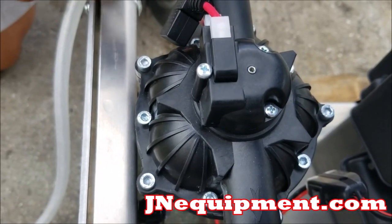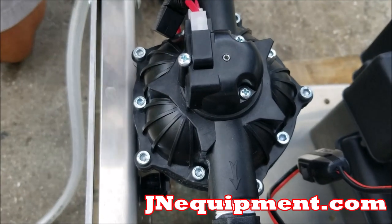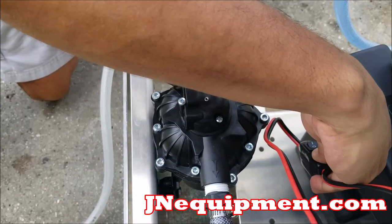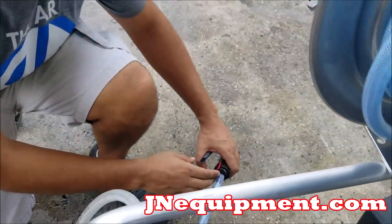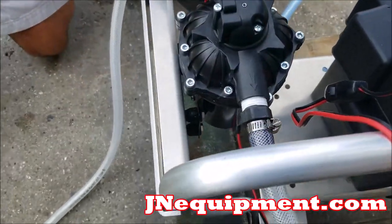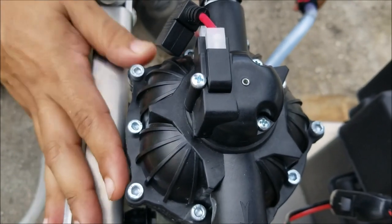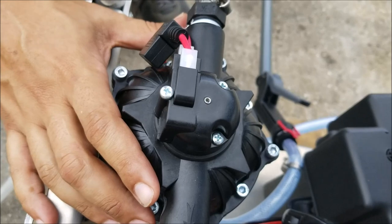Okay, so we just went over that this is pretty similar to a pressure regulator, but there's really only one situation when I use this, and I'll explain what's going on as we go through it. So I'm gonna go ahead and flip on the pump. Okay, pump's on, and I'm just gonna put my trigger on automatically turning on. I want you guys to notice, when the pump is running, it's not clicking on and off at all. It's running in a consistent state, and when I release my trigger, the pump stopped running about a second or a half second after I release my trigger.